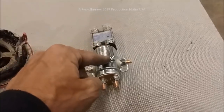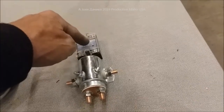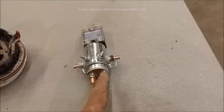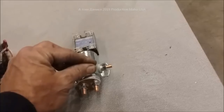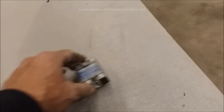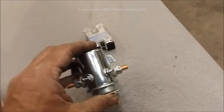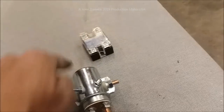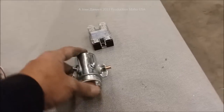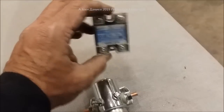If they're screwing you on this, what else are they selling you? This solenoid is dangerous; the SSR is safe. The solenoid fails in the locked position because heat welds the copper plate and terminals together — fire risk. The SSR always fails in the off position — no fire risk. You can't put two of these solenoids side by side either, because the power they suck out of your batteries would destroy them fast. The SSR is what you want.